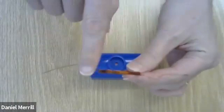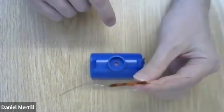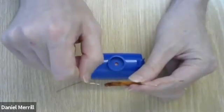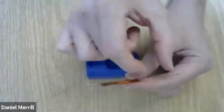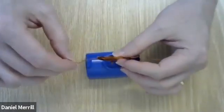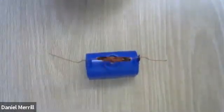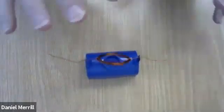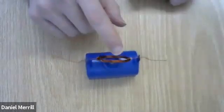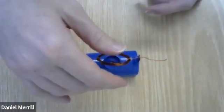On two sides of the wire loop I've stripped away the shielding — right here and right here I've taken and scratched off the shielding so that right on those locations it will connect electrically. So if I put it down like this, I get a little circuit. If I let it sit there, it's just wiggling back and forth because my loop isn't perfectly balanced. It's going to run current and heat up because there's resistive heating — the copper has some resistance. It's not going to do anything very interesting, though.